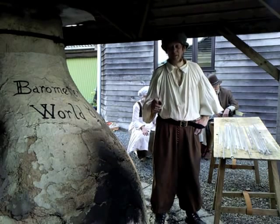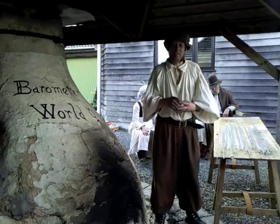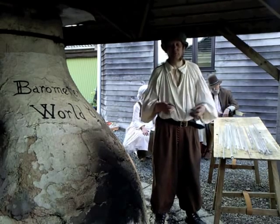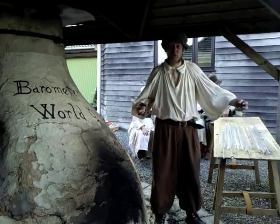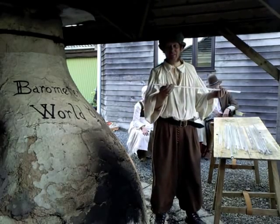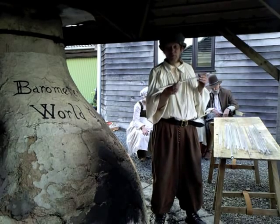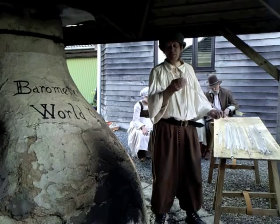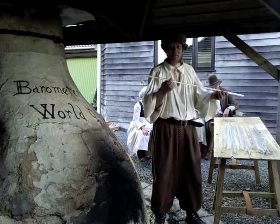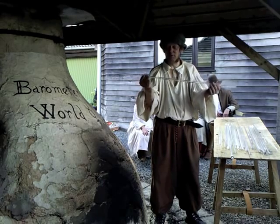It's difficult to make, that's true, highly skilled. But when you make a gather of glass with a bubble in it and get a punty attached to the end and pull it apart, rest it on bits of wood, you make long tubing. You can make tubing, and we've made quite a bit of this at this kiln, truthfully not today. This is about 10-12 millimeter diameter. We've got a reasonable bore in it of about 6-7-8 millimeters, and it varies a little bit, but as you can see, this is a fine piece of tubing and would make nice barometer.